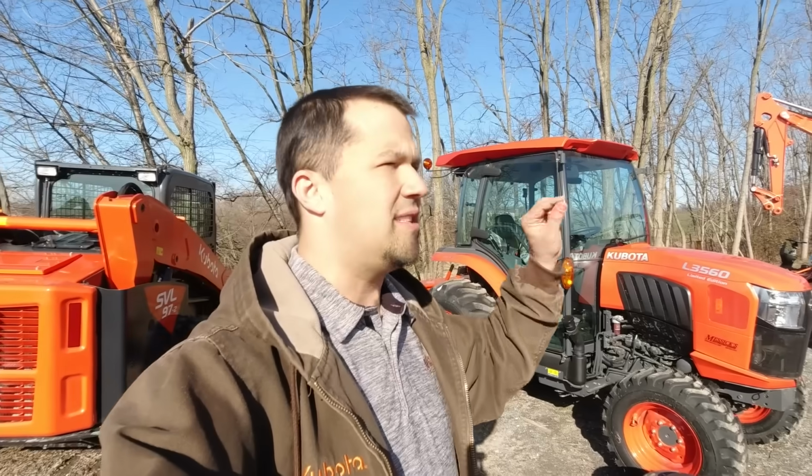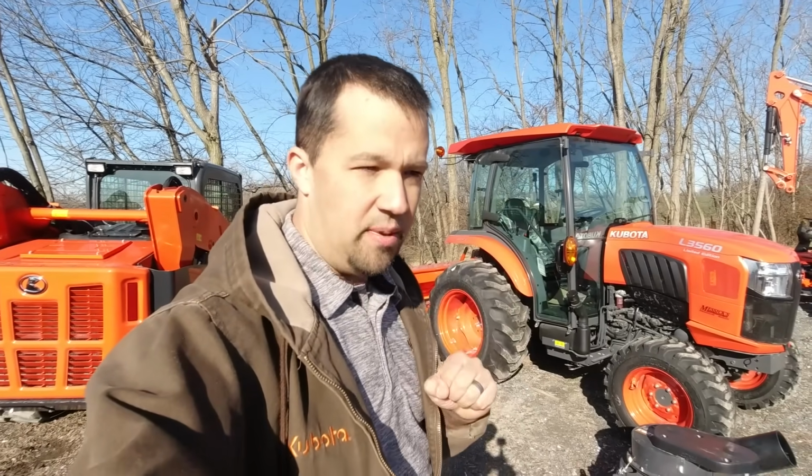Now, there is a little bit more flexibility here. If you're staying within the same product series, say a Kubota GR series garden tractor or a BX series subcompact, there are some cases where you could take mower decks from one generation and move them on to the next. That's usually going to be reflected in their model code. So the current 80 series BX tractor, for example, uses a -23 BX mower deck, and that carries back into the prior series, starting from about the 50, 60, 70, and 80 series are all using that same -23 BX mower deck. So sometimes you could pick up on the places where this is maybe slightly possible by watching that full model code and watching for commonality between one to the next.